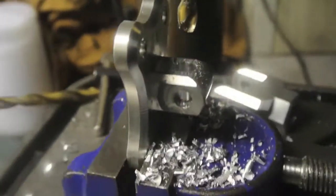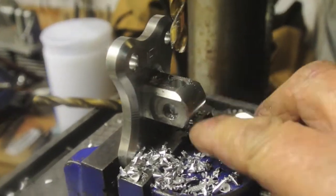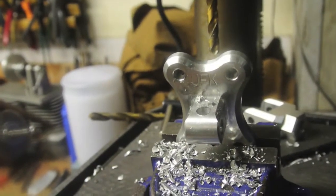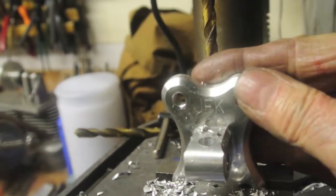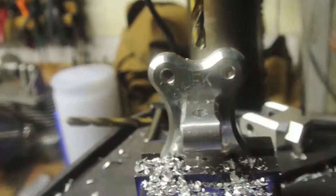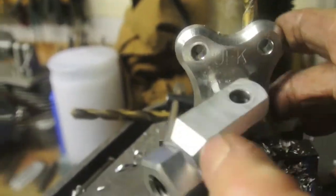Another modification I've had to make is to drill a hole at 90 degrees to this one in the bracket. Once I tried it on the machine I realised it was 90 degrees out, but there's no other way to mount this — there isn't enough room to mount it other than vertically. So I had to pop a hole through there so that this will fit on.